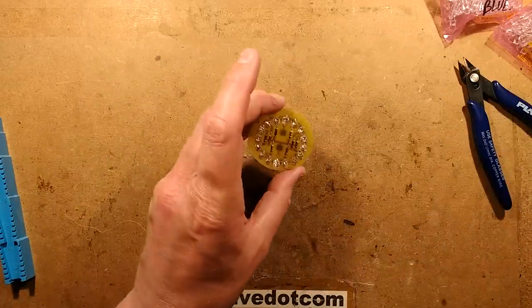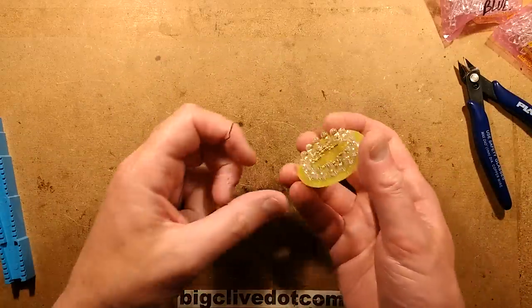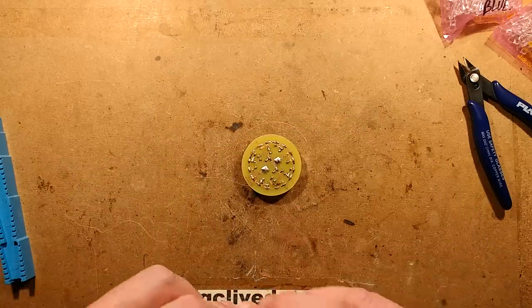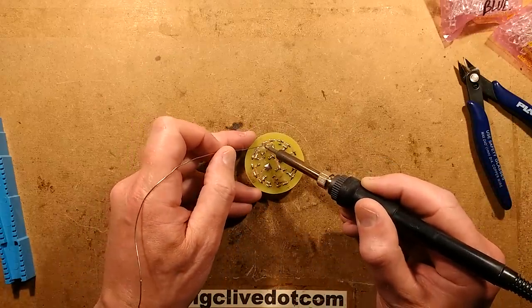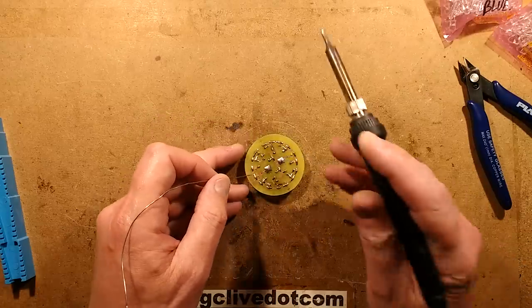Stunned silence, and then I burst out laughing because it was just so silly. All that work leading up to that point and then the explosive failure. And the reason it had failed explosively is because right at the very last minute, I'd made a slight design modification. I thought, oh, I could route the track down there because why didn't I do that before? And it turned out the reason I didn't do it before was because I basically shorted the supply rails.